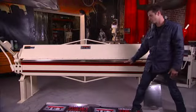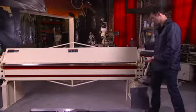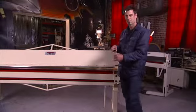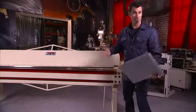Obviously, if you need to, you can remove your apron. Your beam can go back 1 inch, which is a great adjustment — I'm going to show you in a minute how you adjust. Sometimes if you want to change the radius on your bend, or if you want to use thicker materials, you're going to need to move that beam back and forth. If you don't know how it works, let me show you.